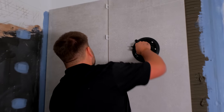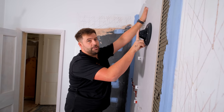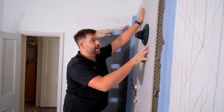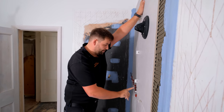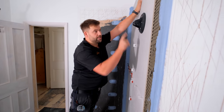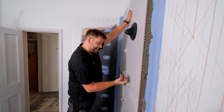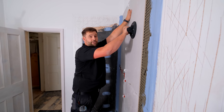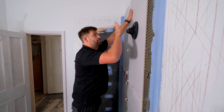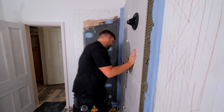On the previous video we did for the outside project down at St. Mary's, using these ruby pads, amazing. These suction pads make so much light work of these big tiles, getting them up in the air. I mean, we can lift them, but when you're trying to place them on top, you've got danger of chipping your edges. These things make life so much easier, because I can control the tile so much easier, and I haven't got my hands behind the tiles or anything like that. Everything's on front of the tile. Loads better. So I would advise showing with the people who use things like this, if you're gonna have a go yourself, laying big tiles.